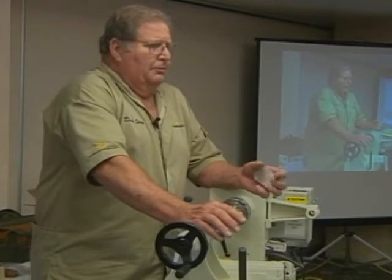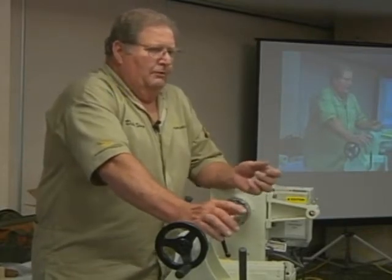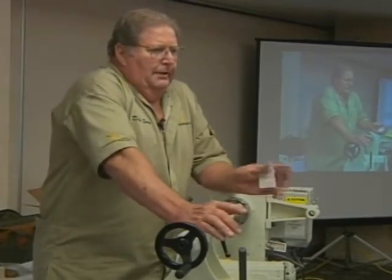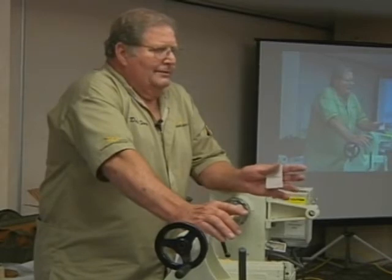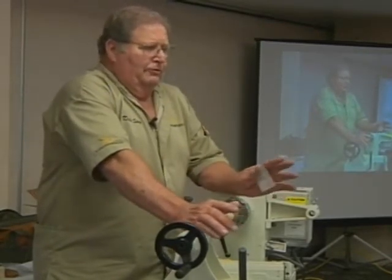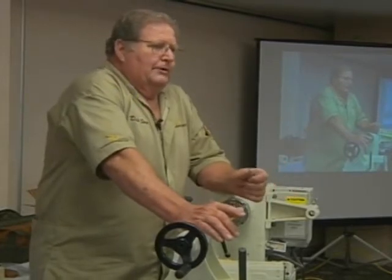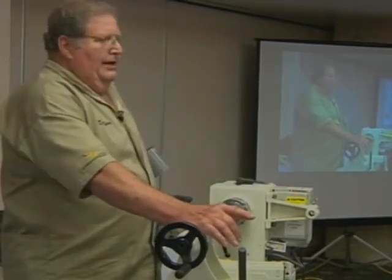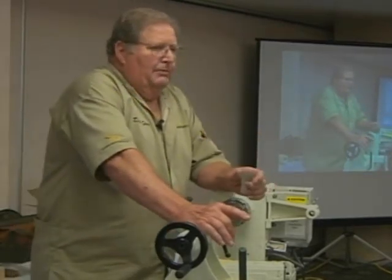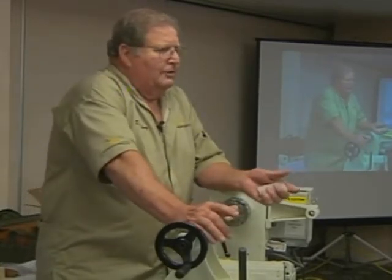I think most people are under the assumption that speed will solve your problems. Maybe it's not cutting quite right. I disagree with that. Sometimes people turn too slow, I will say that. But the majority of times, if they would take the tool and walk over to that grinder and put an edge on it, it'll cut much better. I can cut with the lathe off just turning it, so it's not going too slow.